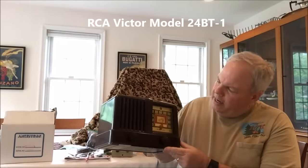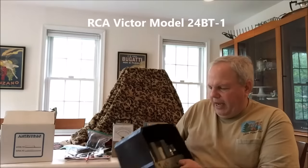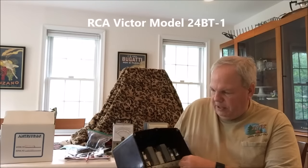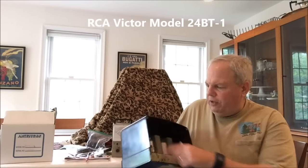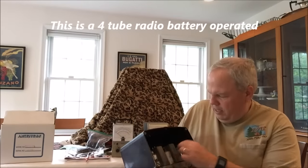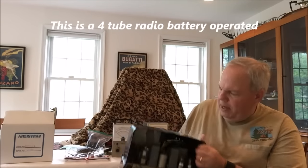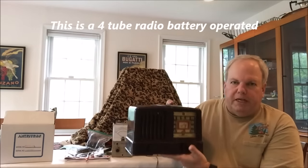Things slowed down a little bit after that because these things got heavy, but I continued on. One of the things I was looking for was another radio for a new project, and I found this RCA Victor. I really liked the red dial in the center — it really looked good, fairly clean. Now, it definitely needs to be restored. In the back they had cut the cable, which was fraying, and that's a piece of speaker wire there. It does look like almost everything's here — an All-American Five. It's a Bakelite case, in fairly good shape, and I thought this would make a great restoration.